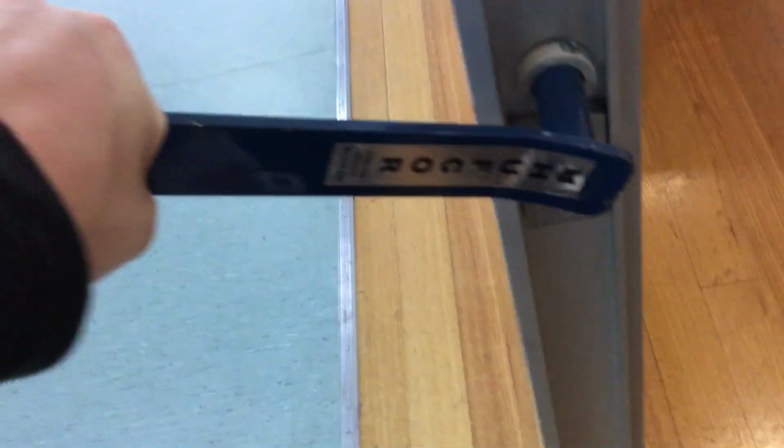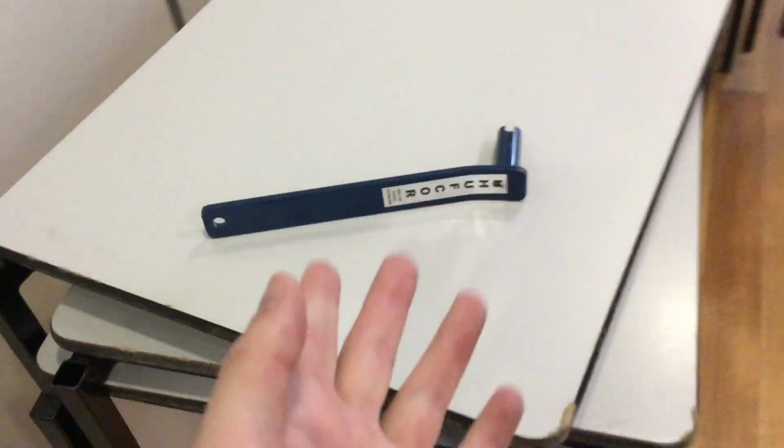Okay, so I'm going to push this panel back, lining it up. Now when you seal it you want it to be straight, so turn the crank clockwise like that until it clicks, and now it is sealed. Okay, now with this operable wall they keep the crank in the pocket so they know where it is. Once you get your operable wall sealed up, I'm not going to open it up because it's too much of a hassle. When you close your pass door, the mechanical seals automatically extend.